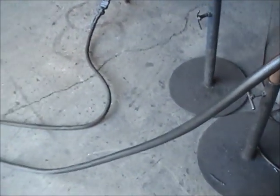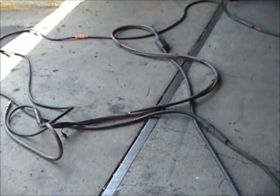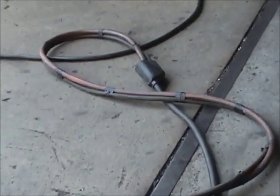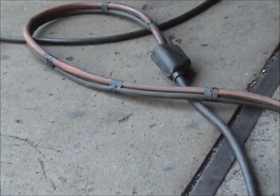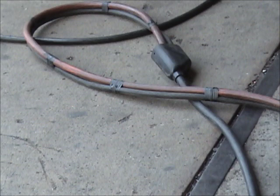This big, heavy, black hose carries the current, and it goes all the way back over there. It's got a big end on it where everything kind of ties together, and you can see where the air hose comes into the back of that. This is what's known as a concentric cable — that shows up on a test, by the way. There's a cable within a cable, or a hose within a cable. All MIG guns are essentially concentric cables, just as a point of reference. Once you get this all set up, that connection becomes a bigger piece.